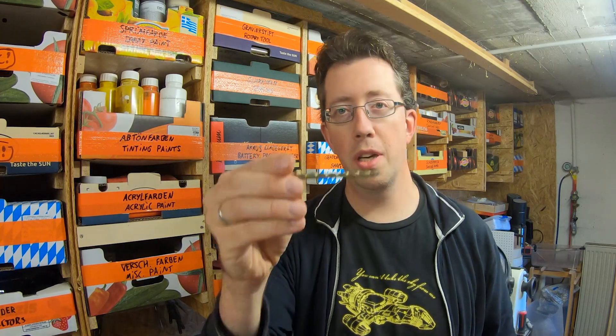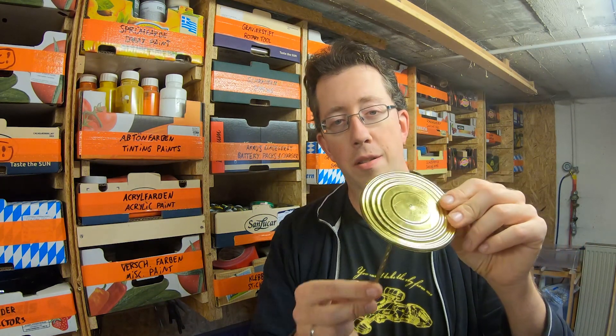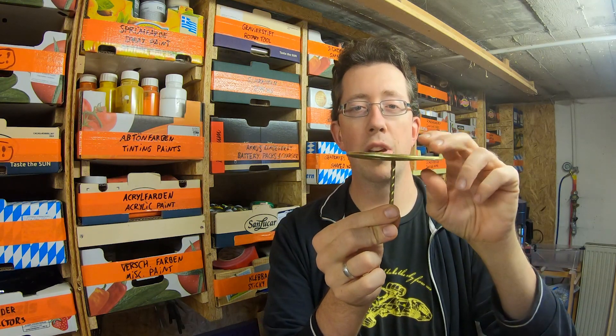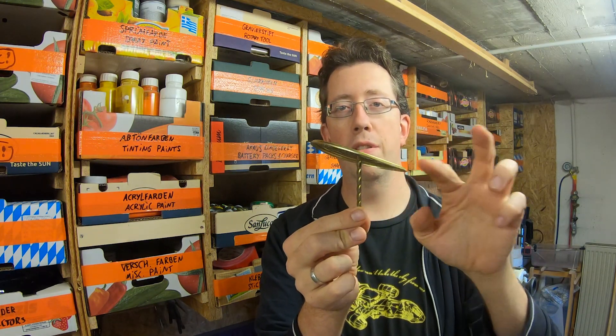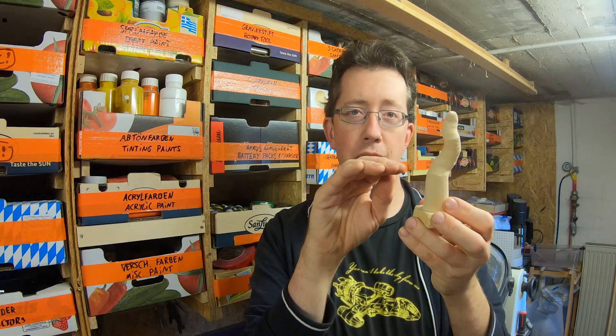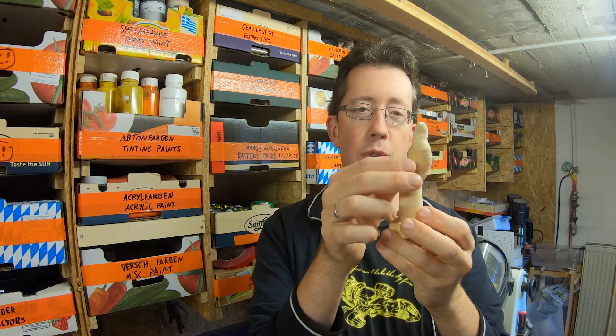So, that's two dimensions, where you have a cut that you can angle. But we live in three dimensions, and so does the dowel you're probably using. There you have a cutting plane, and you can angle it however you want, just like in two dimensions, but you can also rotate it. It's high-tech. So what I did for these is not only did I angle the cut, I also rotated it from piece to piece.